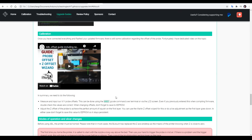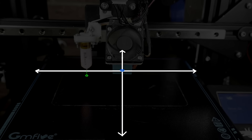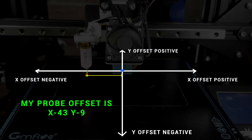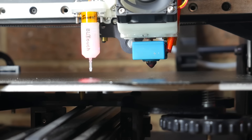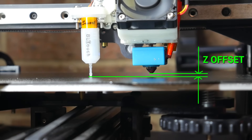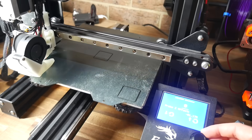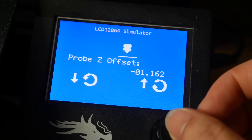Compile and flash your firmware to the mainboard and we're ready to calibrate. Calibration involves telling the firmware the exact position of the BLtouch relative to the nozzle, and I have a dedicated video to this which I've embedded in the page. This video will take you through calculating your X and Y offset, different ways to measure it, and how to communicate it to the firmware. It will also explain that Z offset is the difference in height between the trigger point of the probe and the tip of the nozzle, and show you how to use the inbuilt Marlin Z offset wizard, as well as how to make fine adjustments on the fly while printing.